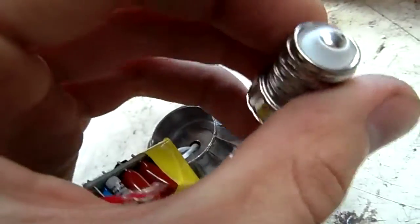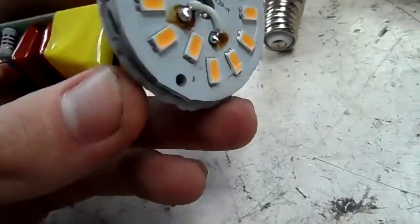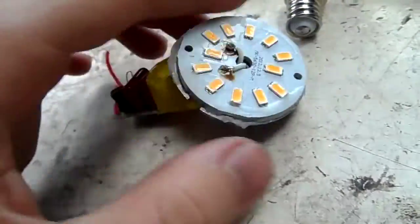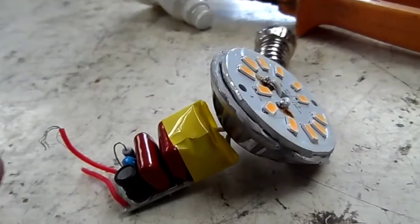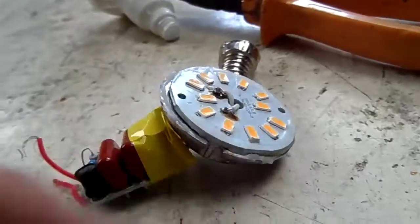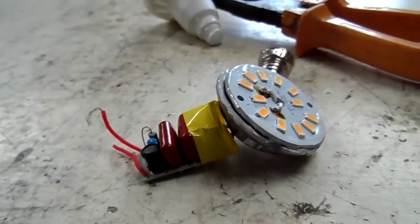This thing did chuck out quite a bit of light when it was working. It was only the cap that buggered up and shorted out to stop it working. Anyway, that's what's inside an LED light — there's really not much to them. You've just got your AC input, a power converter, and your LED assembly on the end. Thanks for watching.